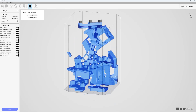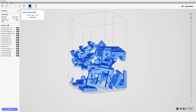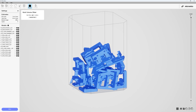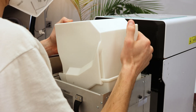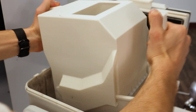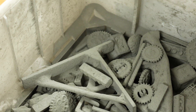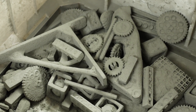Microslicer, which we created in-house, allows you to efficiently pack parts using interactive physics simulation. After printing, just scoop the powder cake, drop them into a sifting bin, and give it a good shake. This separates out most of the unused powder for use in future prints. The finished parts can then be media blasted to achieve a perfect surface finish.